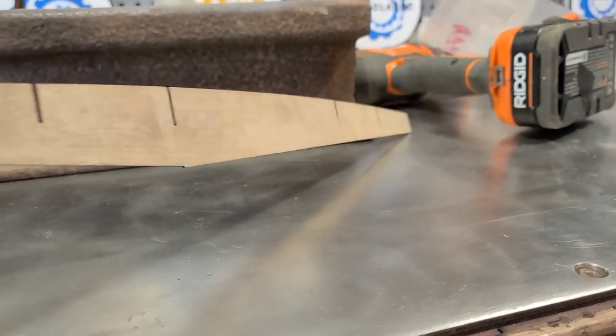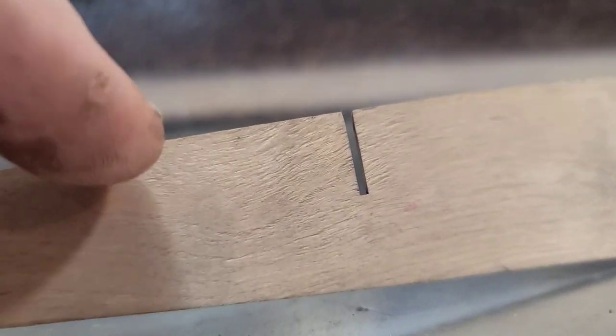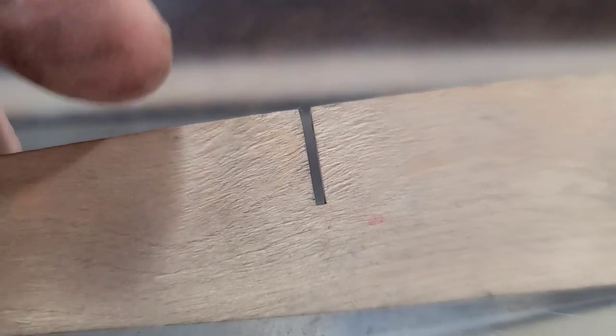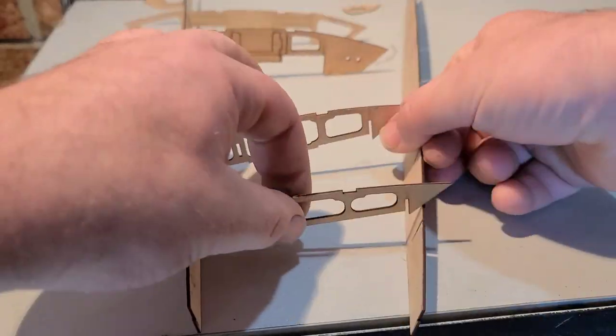All right, so if you got a little bow, right here is what was causing it. Let's see, is this the right side? Yeah, see right here where all that grain's twisted and gnarled, curled and stuff? On the other side, it's perfectly straight. But the one side had this, it looks like the outside of a knot. So it did it. That weight with a little bit of water, it did it.